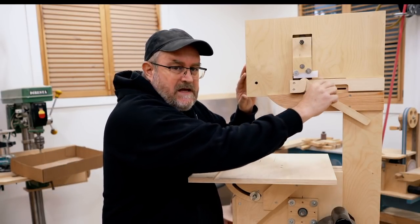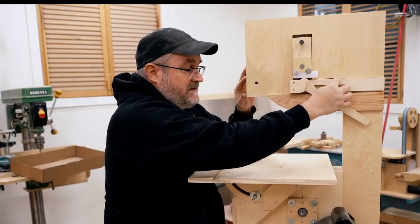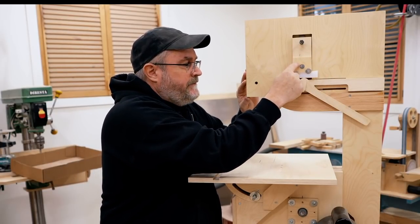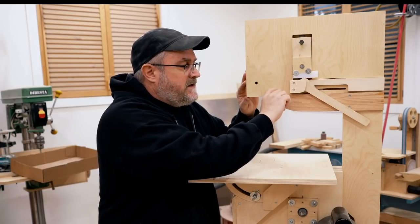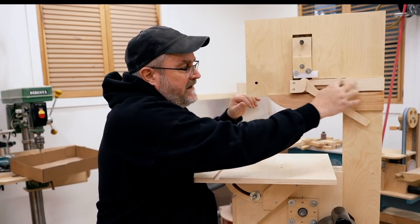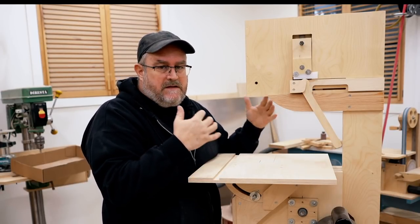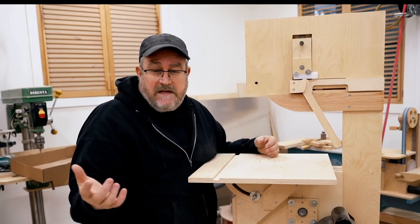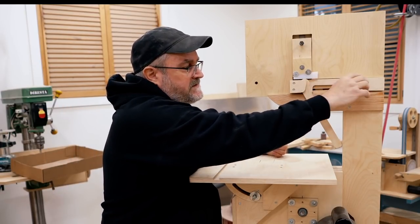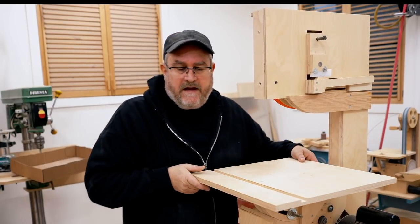The spring on the back here is half inch, and the piece I added up here is also half inch, making the lever half inch. If I had my time back I would have made this three quarters of an inch — the lever, the spring, all of it — because with the extra thickness this piece down here would obviously be way stronger, and the spring would be stiffer. Even with what I added, I think I could have left the spring part not cut out at all. I'll be testing it as I use the saw, and if it needs it I can replace it with a full-length piece or even solid wood. Right now I'm not having any problems — it's putting on plenty of tension for both the quarter inch and half inch blades.